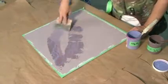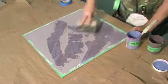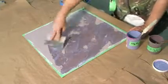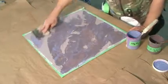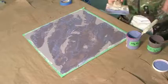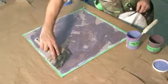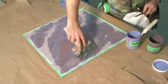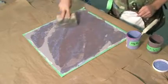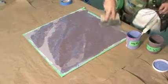When the plaster has dried, take the first color of TO stone and apply fully or in a broken way as shown in this finish. While the first coat is still setting, take a second color of TO stone and fill in the missed areas or fully cover the surface depending on the desired color intensity.